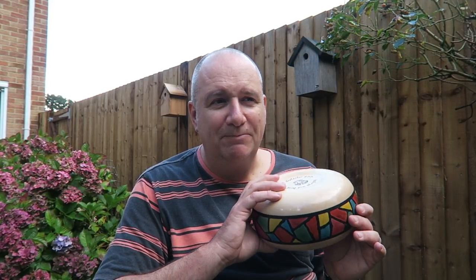I enjoyed using the Carter and Sons tools, but my Pro Edge won't get the right grind angle on the gouge, so I'm going to have to look at re-grinding that. I don't really want to get a second sharpening machine — I like my Pro Edge, it's fantastic. So I'll probably put a different grind on it, because when I went to hollow the bowl it was getting blunt and I couldn't copy the grind on it at all. So I will re-grind it to a grind I'm more used to.